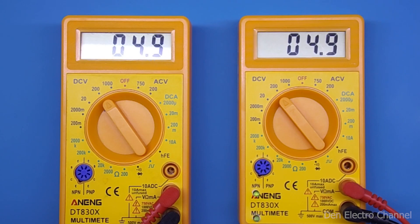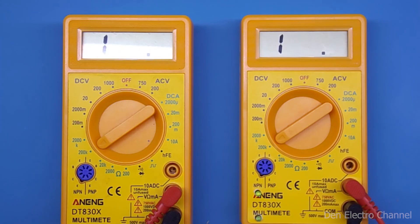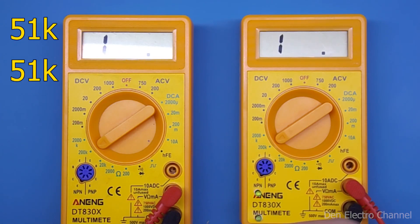In the video the numbers seem illegible and the display is very dimly lit, but I assure you in reality it is not so — the display is backlit very brightly and the numbers are easy to read. On the internet many write that when working from a boost converter the multimeter will fail, as high frequency vibrations affect it and it makes incorrect measurements. To refute this, I will show a comparison of two multimeters. Both show DC voltage exactly the same, the same goes for AC voltage, and the tester also does the measurement of resistors correctly.